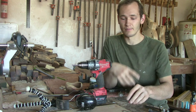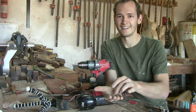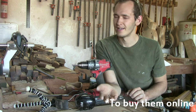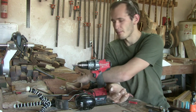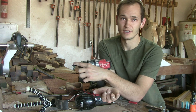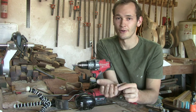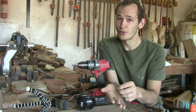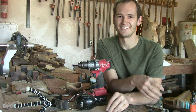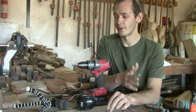The drill press makes nearly perfect dots. I made six or seven just now, and it costs maybe 20 to 30 cents per dot. If you have the tool and all this scrap pearl you're going to throw away anyway, it's worth it in the long run — it pays for the tool itself pretty quickly, and you can pick exactly what kind and color of pearl or abalone you get, which is really nice. So if you liked this video and found it informative or useful, give me a shout, tell me what you liked or didn't like, like it, subscribe, and share it. Thanks for watching — we'll catch you in the next video.